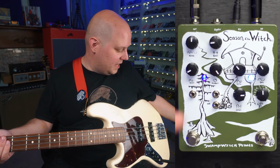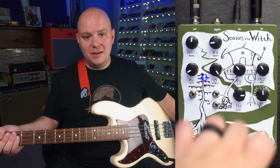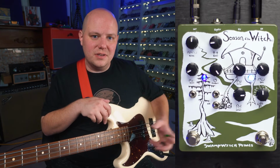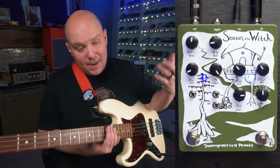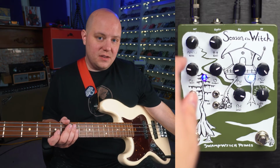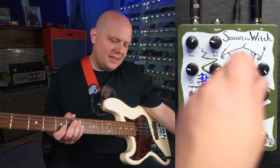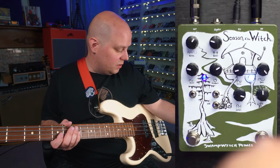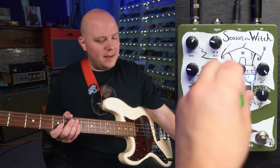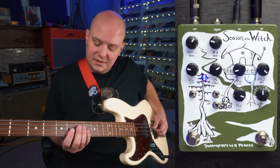That sounds really cool. That was the delay almost as short as it can go, and the feedback pretty much maxed out, so we're getting that cusp of self-oscillation. It sounds like you're in a metal room or something. Now I have the delay controlled by the LFO, and what I wanted to see was how it sounded with a very small amount of depth and a very high amount of offset at a very fast rate. Let's hear how that sounds.